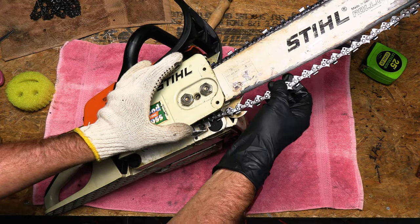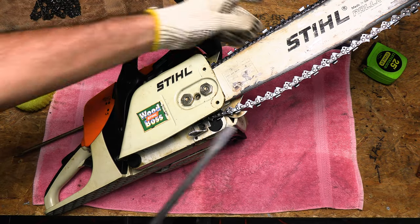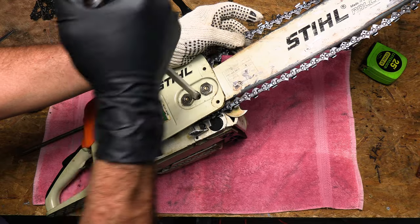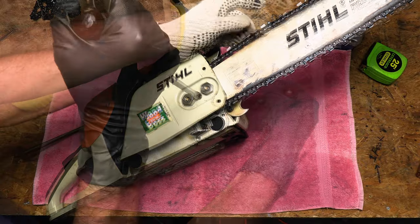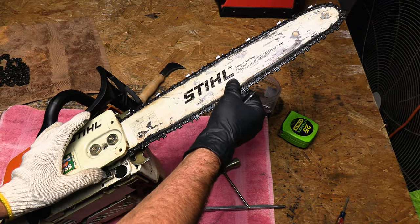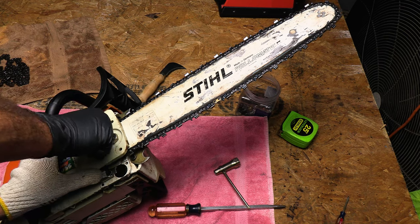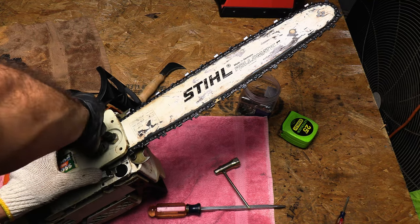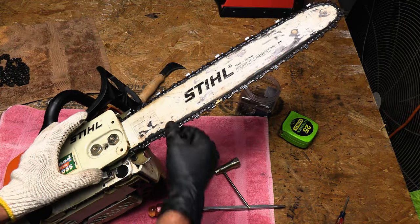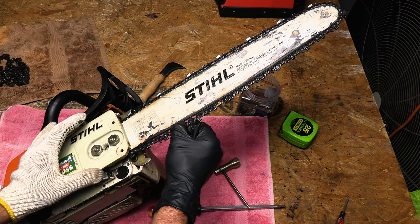See how much slack we got — we got a mile of slack there. Get these a little tighter, but not tight — you don't want these tight. Now tighten your adjuster forward. Notice that the bar has a little bit of slack in there. What you want to do is push that all the way up like so while you're adjusting this. The reason you want to push the bar up is because when you're cutting, this is pushing this way, so that way is up. Adjust it just about like so — that's about right, about good right there. So you have a little bit of snapback right there. Go ahead and tighten these.